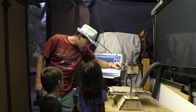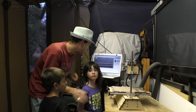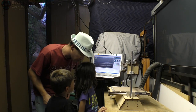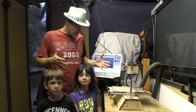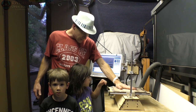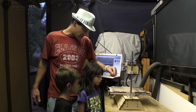So we need to fix this — it's missing screws. We know that the nozzle is working and we need to fix that one. We didn't test the bed yet, so we'll go ahead and turn that on. Don't touch it — I'm going to turn it on and we'll see if the temperature changes. I don't feel anything coming off of it yet. It's still cold, but we'll wait a while because it'll probably take some time to heat up. It's a big piece of aluminum. I got it on a low temperature so it won't hurt your fingers, but don't touch it.